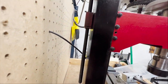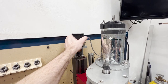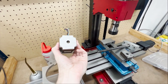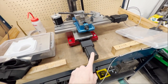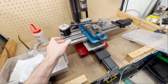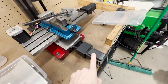With the Z-axis, you can see it still has the old-school threaded rod going into a piece of steel, so that's another thing I could upgrade in the future. But with it just sitting there, I could not hold my hand on the motor. I think what happened is that this motor is rated for only like 2.2 amps, whereas these other motors are rated for like 2.8 amps. I'm pretty sure the CNC board — which is a Gecko board — is set up to run close to 2.8 amps, so I think it was putting too much current through that motor. So I just wound up buying another motor with the same or similar specs.